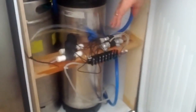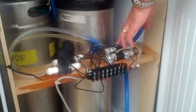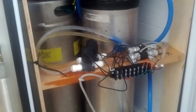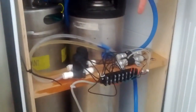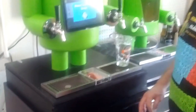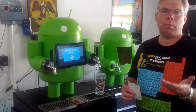And then we'll look at the flow sensors inside and the solenoid valves. We have two flow sensors — these are from Swiss Flow, the SF800 sensors — and then two solenoid valves here. Once you're ready to pour beer and you click pour, the data gets reset to zero and then you start pouring by opening these valves. The impeller inside the sensor rotates and as it rotates it puts out pulses. You count the pulses and with those pulses you determine the flow rate or how much flow has gone by — so many pulses per ounce or so many pulses per milliliter.